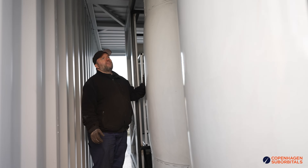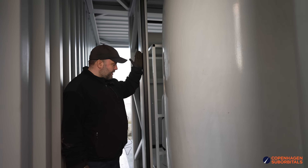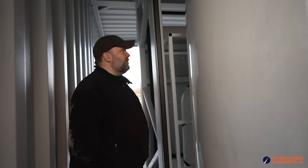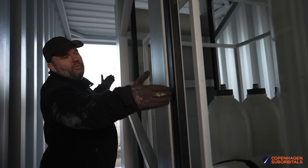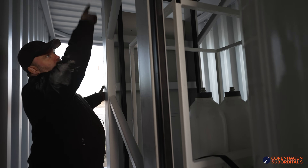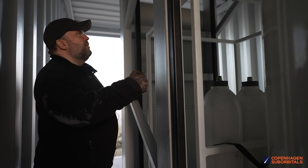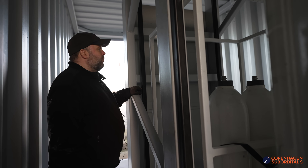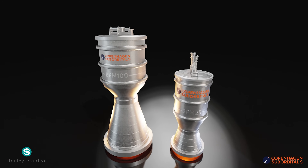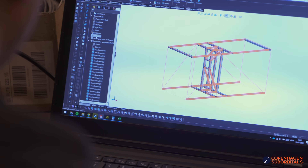The first part is the dynamic frame, which ends down at about this level. Then we get to the fixed part of this test container — starting here with the gray beams, ending over here, with a lot of reinforcement steel in between. This is the static part of the test stand: the structural frame that will transfer all the thrust from whatever engine we test in here to the rest of the steel container and all the structure in it. This thing has to be really, really sturdy.